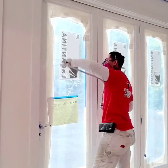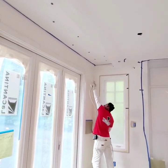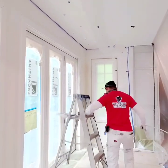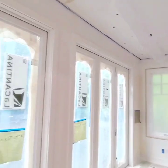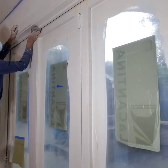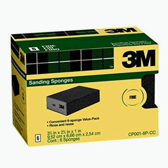I'm almost done priming all the trim. After you finish priming, you need to let it dry — alcohol-based primer can dry in about three to four hours and should be completely dry before you start sanding and prepping. One of my guys started sanding; you'll notice one corner has a wood filler on it. This is the wood filler we like to use — Elmer's wood filler. I really like it because it sands really easily, it doesn't shrink, and it's just amazing.